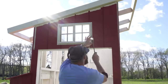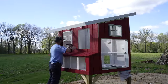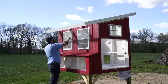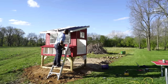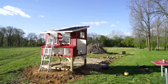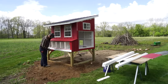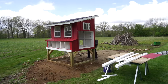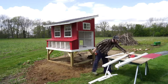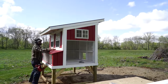Before I put the trim up I first need to install my windows. I found these windows on Amazon — they're really affordable little shed windows and they work really well. I have links to those down in the description. I'm going to use a small window above the door and two slightly larger windows in the back. Having windows on two different walls really is going to help with ventilation and light. I decided to install metal roofs for the coop and run, which was super easy and they look great. I used four-inch, three-inch, and two-inch trim in certain places, secured with a 16-gauge brad nailer.